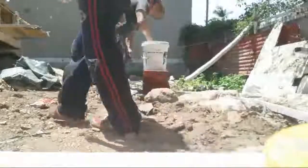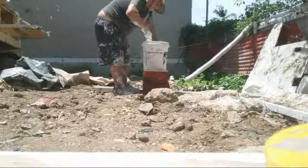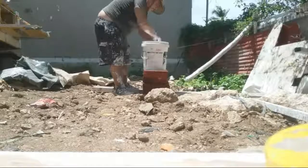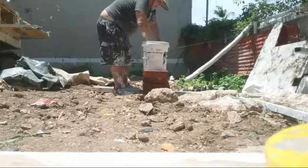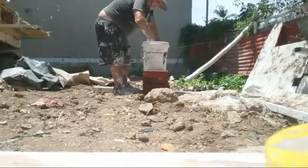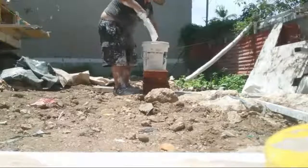I want a nice thin coat on here to go into the grain of the lumber. I just want to keep a little bit of paint on it. I don't want to paint them, I don't want them to rot internally. I just want to seal it up. So I'm thinning it out the standard 20%. The paint that comes out of these cans, if you put it on plywood at 100% on the first coat, it'll peel off. In 3 weeks, when it dries, you can peel it off like the skin off a grapefruit or an orange. It'll just come right off.